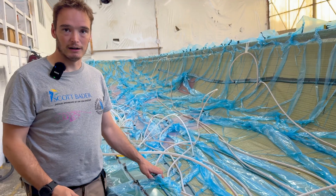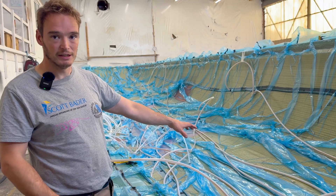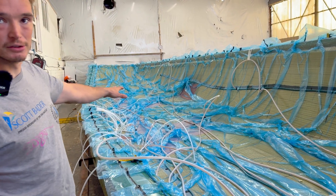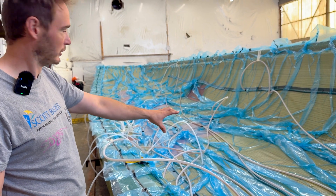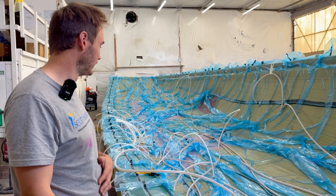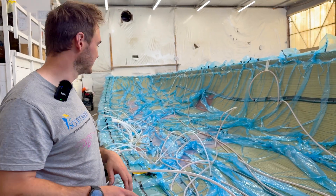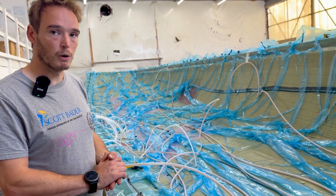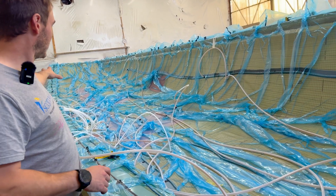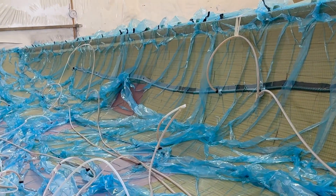Then we laid up our basic laminate — a layer of glass before the core. We're using a Diab core kit here, a really good advanced core kit. It's the first go in this hull and most things fitted really well, so big thanks to Diab for that. We've then got another layer of glass plus extras over different places, a few carbon reinforcements where required — like chain plate extras — and some dagger board monolithic areas around the hull, to get our structure up.